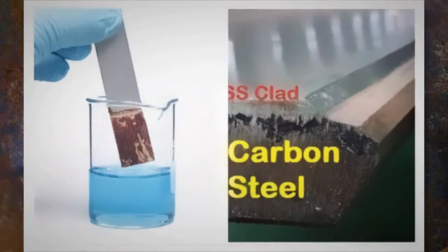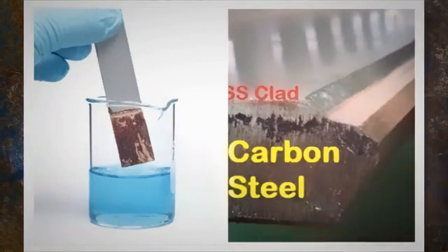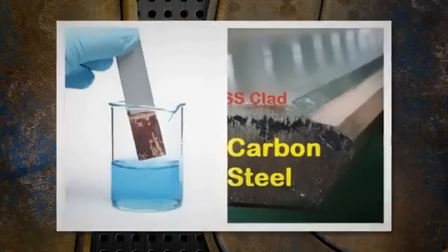This highly sensitive technique is advised for detecting the presence of iron or iron oxide on the surface of austenitic 200 series and 300 series duplex stainless steel, the precipitation hardening alloys, and the ferritic 400 series stainless steel containing 16% chromium or higher.